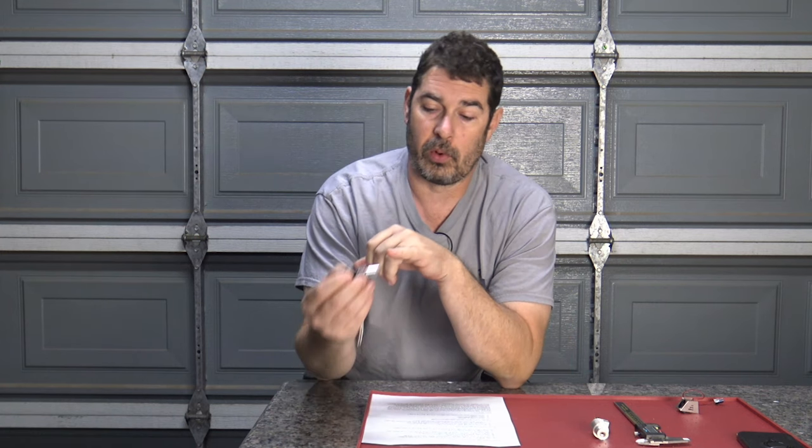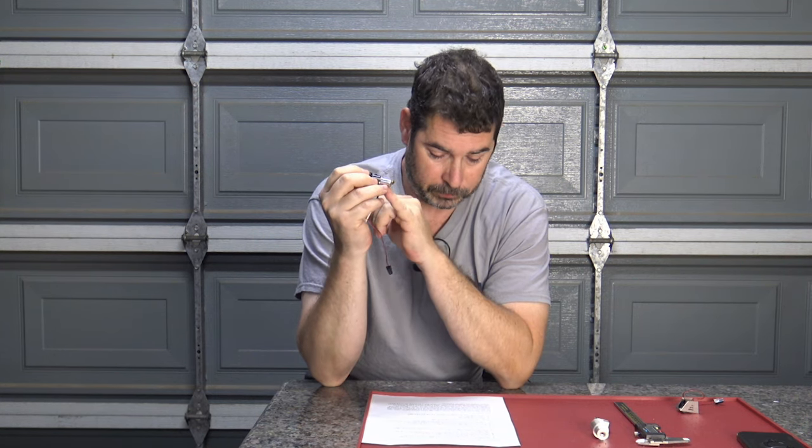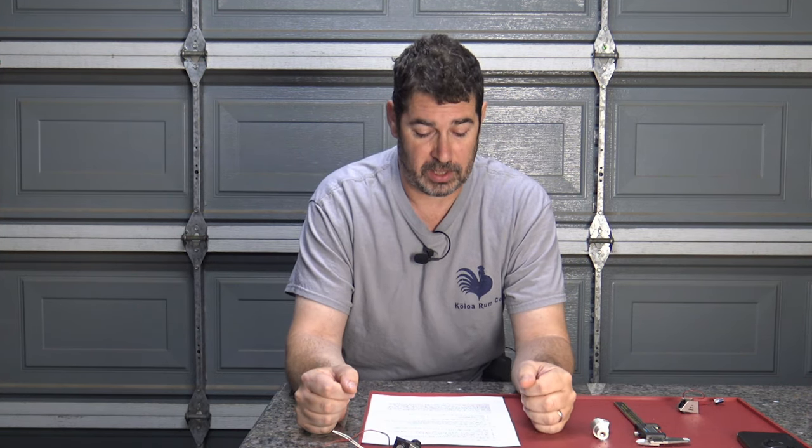They are also going to be including a silicone sock with every one, and they're going to be introducing more nozzle sizes other than the original limited 0.4 that was available at the time of the beta. And they're going to be putting out a version that will handle up to 500 Celsius. So that's a lot. That's a huge melt zone in such a tiny little device.